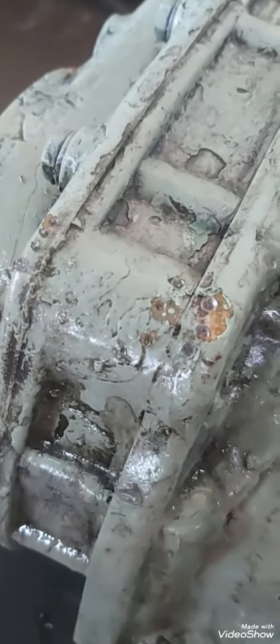I can see the plates are worn out — that is the reason — and there is a lack of clearance. So the blower is not moving freely by hand and is not giving air as required for the engine.